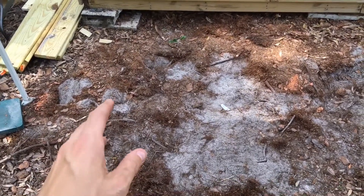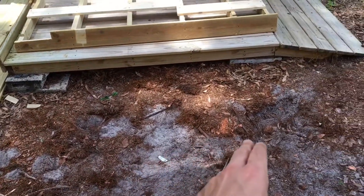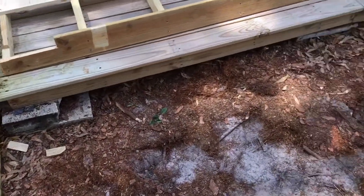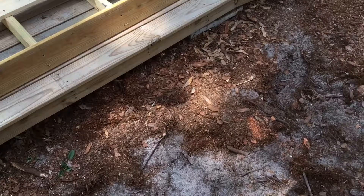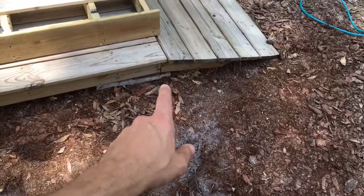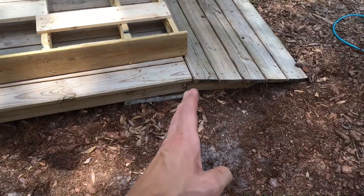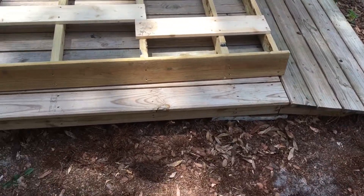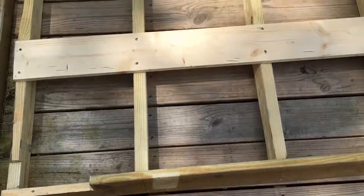I ended up just digging these down. I built this, put on the cut angle I needed — which I used the existing ramp to mirror — and that is an 80-degree cut, so just take off 10 degrees. It gives a gentle slope.